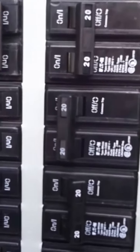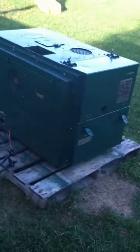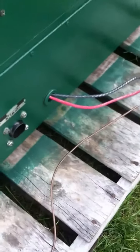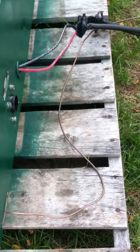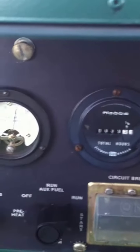I'm going to come back over and open the access door. This one has been flipped on previously. Now I'll bring another heater online — that is 3,000 watts. I want to make sure to note there is absolutely no smoke coming out of this. It's running at about 60 hertz, right where you want to be, and that is 75% load.